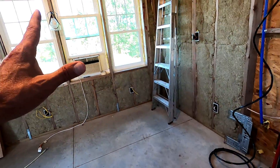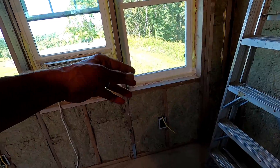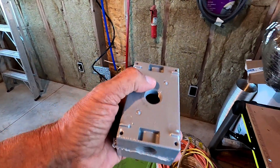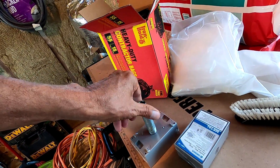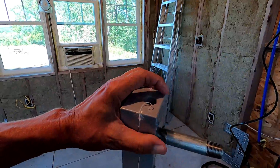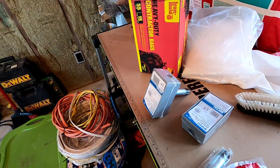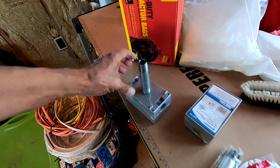What I've seen on other YouTube channels where they're wiring up exterior outlets is basically all they're doing is drilling a hole through the wall and screwing the box on, then just running the wire right through that hole in the wall. Sometimes a goober of silicone on the back there. That is not how to do it. What you've got to do is put a nipple on it and then drill your hole big enough so that you can foam. Once you've got the pipe coming through the wall, you foam that up to seal it, then run a bead of silicone across the top just to keep water from dripping back there — just an added bonus. And then you actually put these little caps on the back so that your wire isn't in contact with the burr back there.